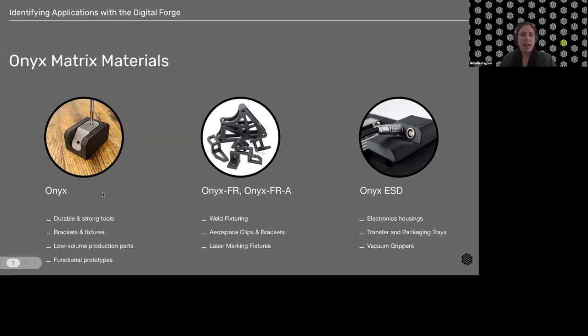With Onyx, we're generally seeing very reliable prints, pretty good accuracy, and very good surface finish. Using that nylon-6 base, Onyx is generally very good for chemical resistance. Our biggest concern overall impacting part performance is humidity — when Onyx is exposed to a high-humidity environment, submerged in water, or exposed to water-based coolant, we may see those parts deform. So we want to know the part's environment and compare that against the material data sheet.